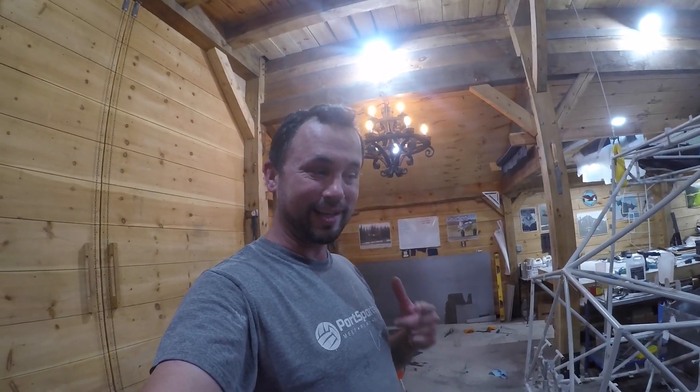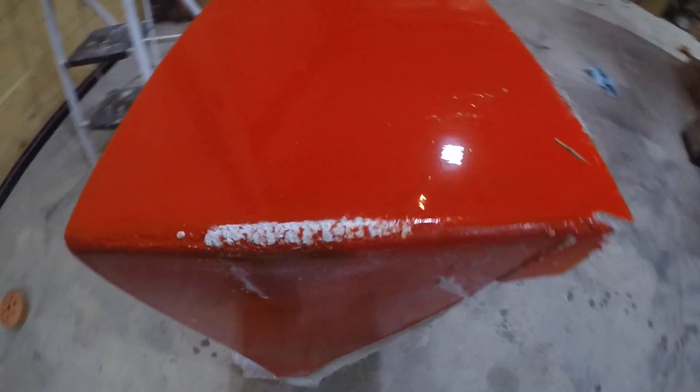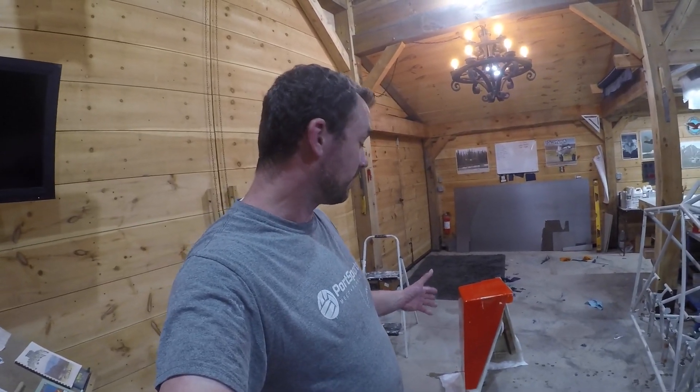As is the case with composites and all the molds I've done so far, there's always a mistake and it's always a different problem, even though the process doesn't change, which I'm struggling to deal with. In this one, the corners that bubbled up — what happened is the PVA, when I sprayed it on, it migrated away from the corners, and so the gel coat hasn't cured. That is because this mold is sealed with epoxy. There's some chemical magic going on between epoxy and polyester gel coat — when polyester gel coat is in contact with epoxy, it will not cure. The corners will probably be easier to fix than the large surfaces, so I'm going to fix this, and that's going to push back making a part by a week.